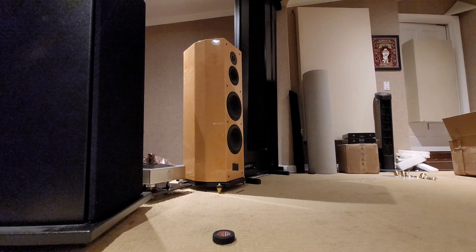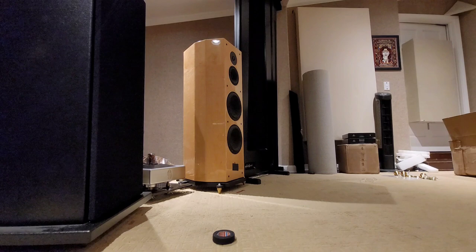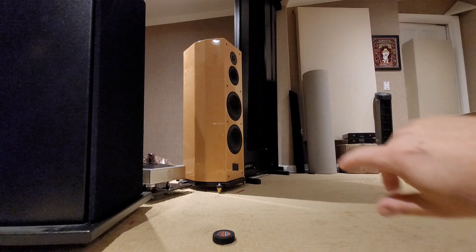You're going to have one amplifier, basically, with the passive. The idea is you got one amplifier, one channel is pushing this, and then it's just dividing it off into wherever it's going. Now, with an electronic crossover, like I'm showing you in a second, you're crossing it over before the speaker. You're crossing it over, actually, before the amplifier.